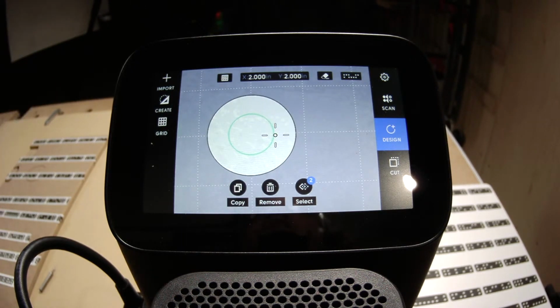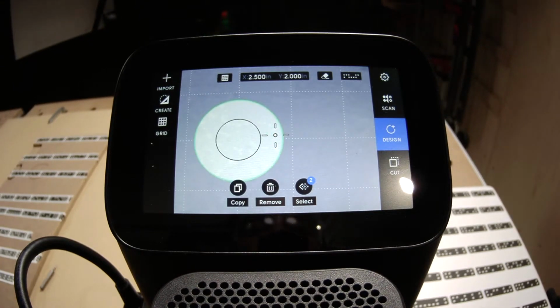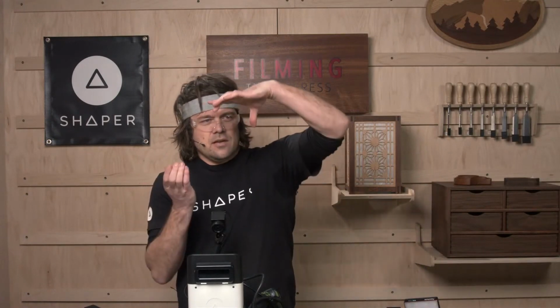So you saw the outcome. We won't bother actually cutting it, but we could then cut 2 of these and get those perfectly parallel fixture to just secure that metal long enough while we weld it. And this was like a relatively low volume, right, Dylan? Yeah, this was just the beginning of the development phase for that. So we were making 2, but it's a valid manufacturing prototype to develop the process.